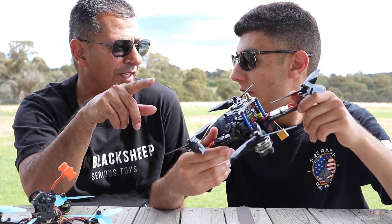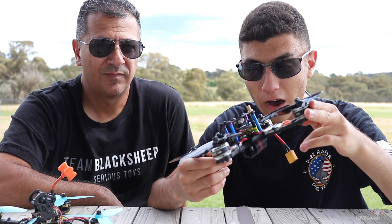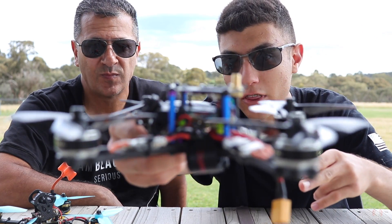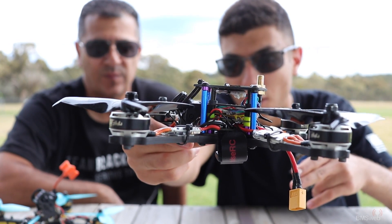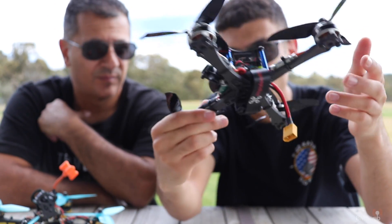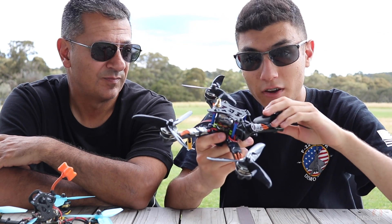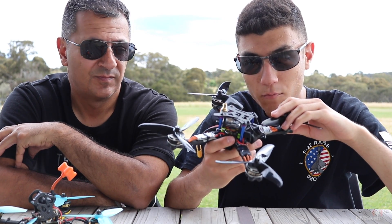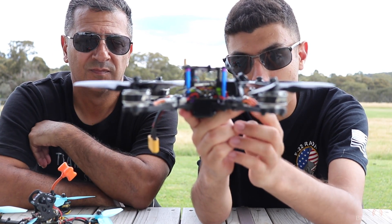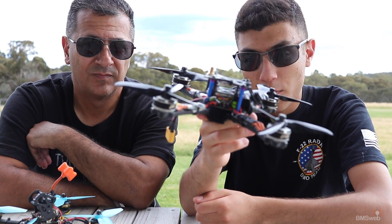Because I couldn't get the frame ahead of time, I knew I'd have to build it at the IO, so I wanted all the electronics done beforehand. I laid the entire stack out on a piece of paper at home, realized the geometry was about the same as an alien five-inch, so I literally built the whole thing on a five-inch alien and hover tested it. I built the stack, and the reason I did the 3D-printed mount was because I wasn't sure how it was all going to line up — I figured if I use my own mount it might be a pain to fit but it's going to work.